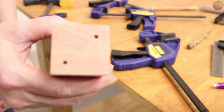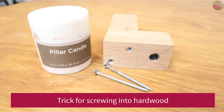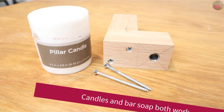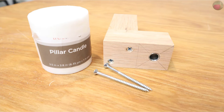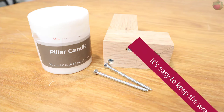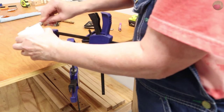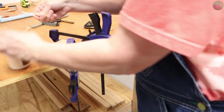The holes have been started in that second block. Here's a trick to ease putting screws into hardwood — my dad taught me this. When screwing into hardwood you need a little something to lubricate it. I prefer candle wax to bar soap, but either will work. Just ensure you get unscented candles so they have no oils in them. Candles are crazy cheap at the dollar store, they stay wrapped in plastic for easy handling, and they don't flake off as much as some soaps. Scrape your screw across the candle to get some wax into the grooves — you don't need much, just so it's loaded. Then twist it smooth.